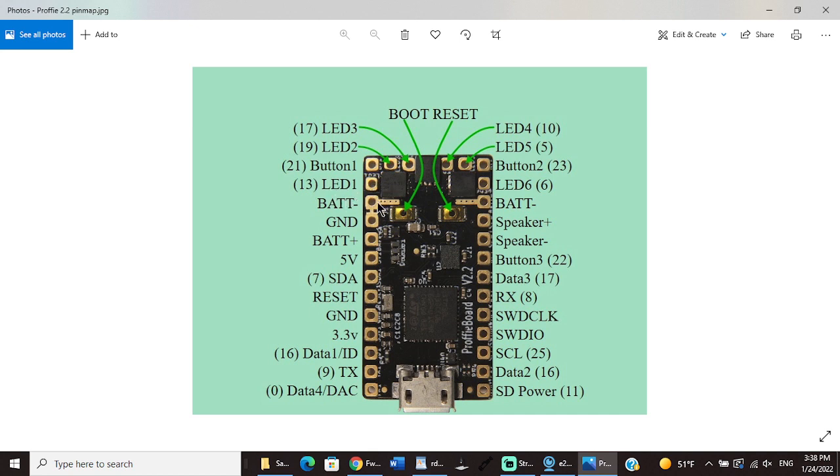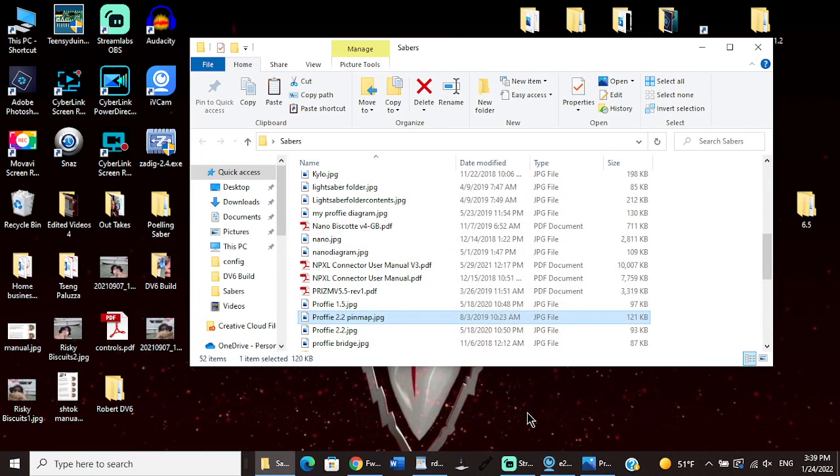And then our battery negative, which is actually our white wire coming from the recharge port, is going to attach here. Ground is our common grounds from our switches. And then battery positive is that merged 26 gauge single positive wire coming up there. Next we come down to data 1, which is going to be our main blade, our purple wire. And then data 4 is going to be our data from our spooling accent in the lower portion of the pommel. So that's the plan, that's the scheme, that's what we're going to be doing.